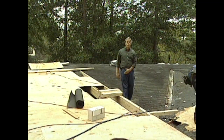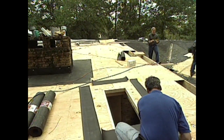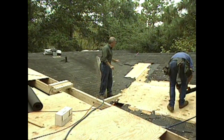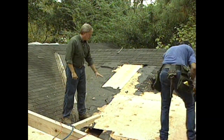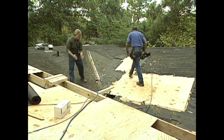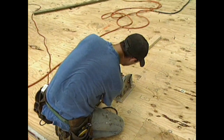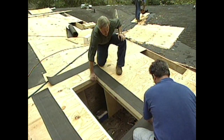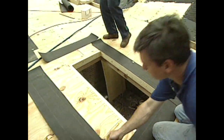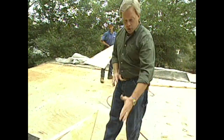It's taken a little over a day to get to this point on the roof — most of the rafters are in place and most of the plywood decking is complete. Dennis is finishing up the closing off of the two skylights we talked about earlier, decking over them and putting black builder's felt over it. Around the skylight openings, Mike is putting felt flashing in preparation for the roofer arriving tomorrow. Near the fireplace, they've also applied felt — the roofer will flash all of that during installation.